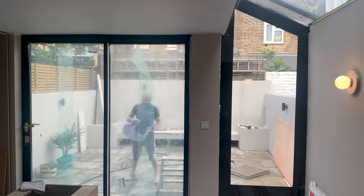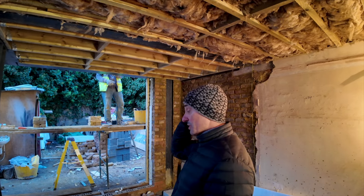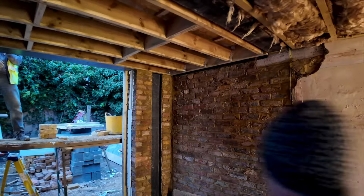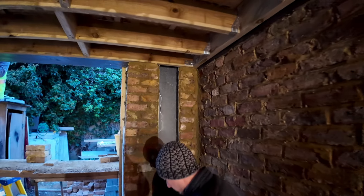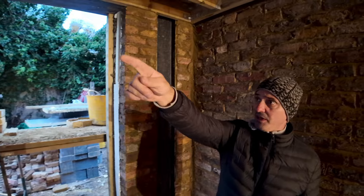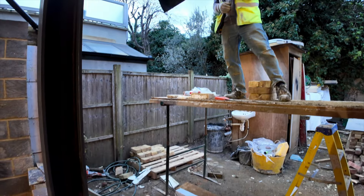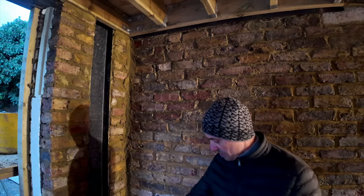We need to have a meeting with the glazing guy who took the measurements — it'll be ordered, and he said he may have it before Christmas. Normally it's six to eight or six to ten weeks, but he'll do it quickly for me. This one was designed by the structural engineer with a big pad concrete underneath as part of the structure. This house required a lot of steelwork because it's a cantilevered level — that corner is empty and requires extra beam support with a big pad foundation.